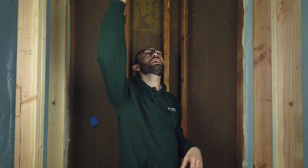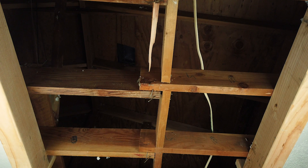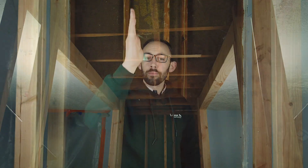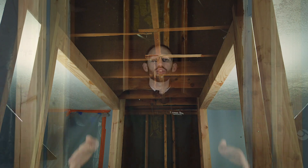I've got two temporary walls on either side of me, and we've got ceiling joists up here that are running perpendicular to those two walls. What we did is we took out the wall that was running right here — we've already demolished it. And next week, we're going to come in and install two micro lams here as beams to hold up the ceiling joists.